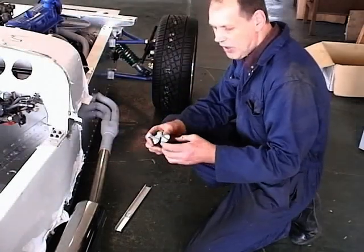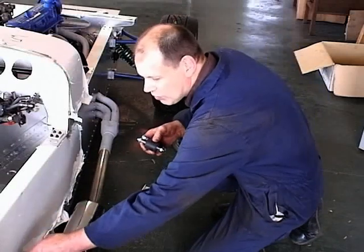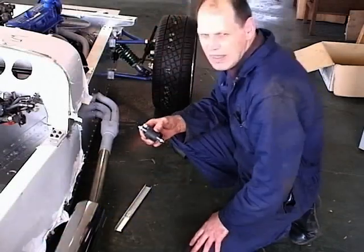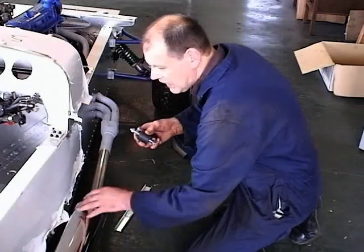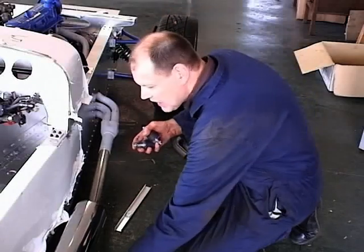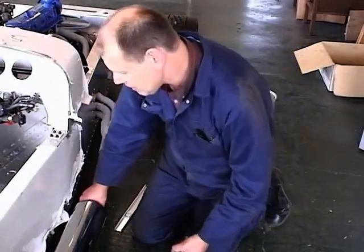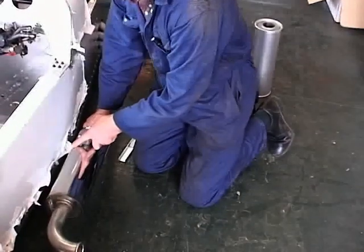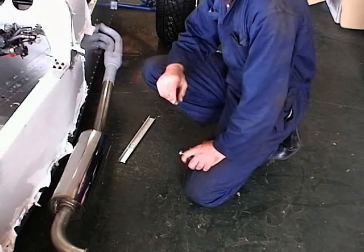But having said that, providing you don't over tighten that bolt, they're quite satisfactory. So you'll need a little extension bracket, and the lads will be given some license there to make a bracket themselves off the body to bring that out. Ideally, the silencer needs to be parallel with the bottom of the body, and ideally, the box needs to run parallel with the side of the car to make it look attractive. So they'll do that, I'll leave them to do that.